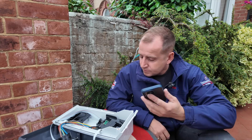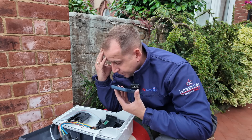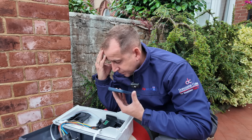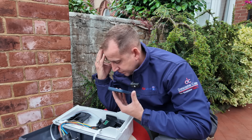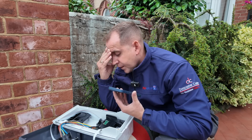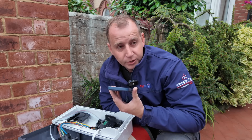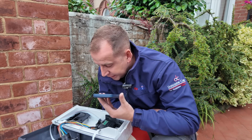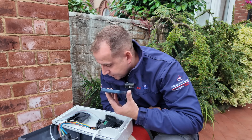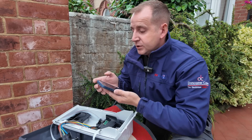I also asked if any components have been changed. The Wago clips have been improved, so we shouldn't experience what happened with the old unit. There are a few other things — he's not sure exactly as he's not in the warehouse — but the Wago clips are improved, the wiring is a lot tidier inside, and there shouldn't be any issues with loose cables dangling over the tamper sensor. I mentioned the line conductor on the Wago appeared burnt, and also the line conductor going through the CT into the PCB module — he confirmed that's a known issue resolved in the Gen 2, including an updated PCB module.